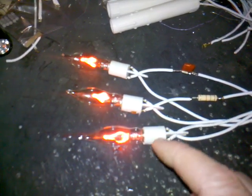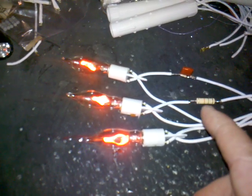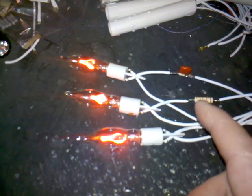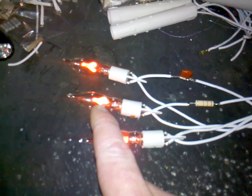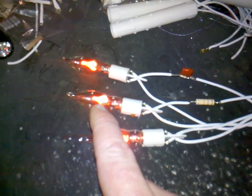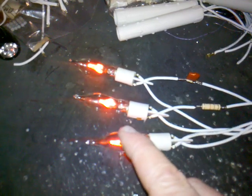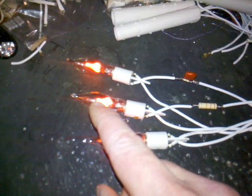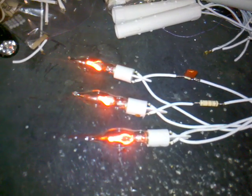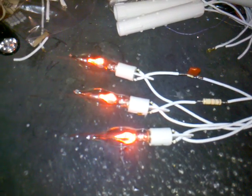In the case of the middle one, I put a 10k 1-watt resistor in and about 46 volts was dropped across it, which gave a power rating of 0.9 watts — that's dropped more than half a watt. The current went down from 6.2mA for the original to 4.6mA for that one, and visually there's very little difference — just as much movement and just as much discharge over the surface.